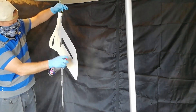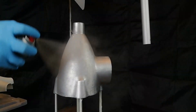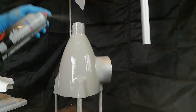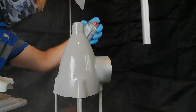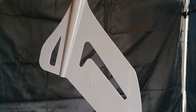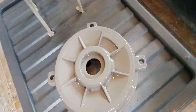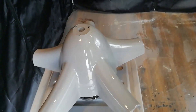I wasn't sure what color to paint it, but thanks to a few of your suggestions in the comments on the shorts video I decided on battleship grey in the end. To do this took two coats of grey primer followed by two coats of clear lacquer. Once the lacquer was applied it had a lovely mirror finish, and after it was left to harden for 24 hours it was ready to face another season of harsh weather, which should definitely last longer than the original paint job.